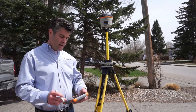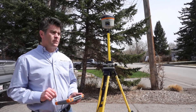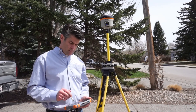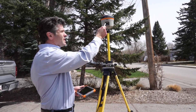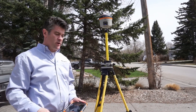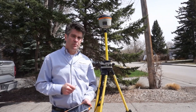I'm just going to say okay, and then hit Connect to start the RTK broadcast. That's going to take a few seconds. When it starts to go, you'll see the top-left LED lights start to blink red, and you know you're transmitting. That's all you have to do to set up a base using Field Genius on an unknown point, measuring the HI.